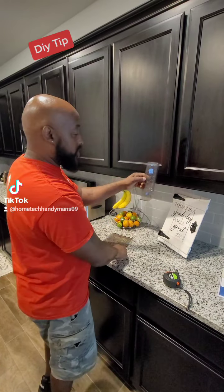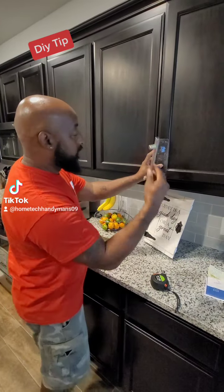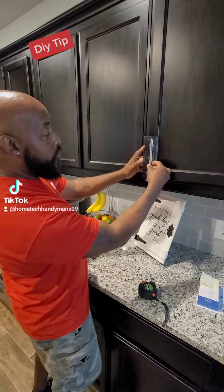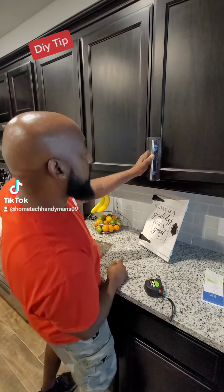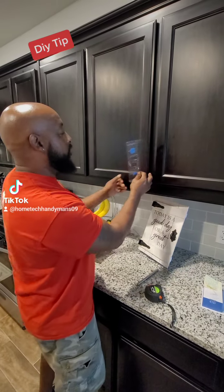You find the five inches on the template and find the halfway mark of where you want the hardware to be. Where I've got the blue tape marked is where I want mine — right dead center of these raised panel cabinet door panels. Then you flip the template over.